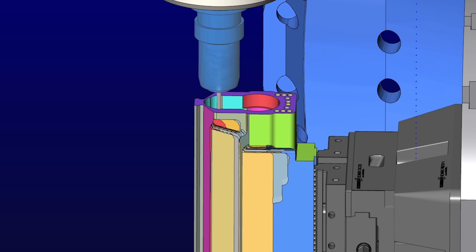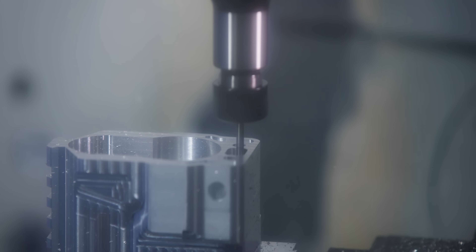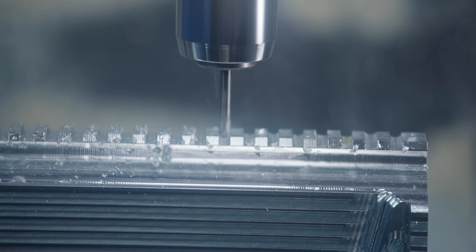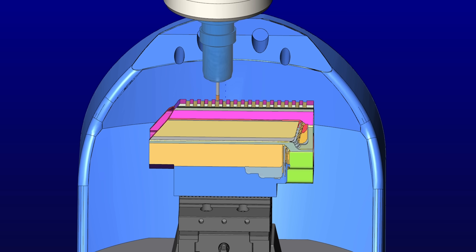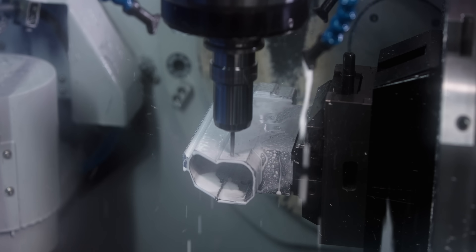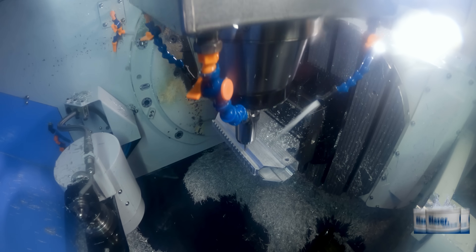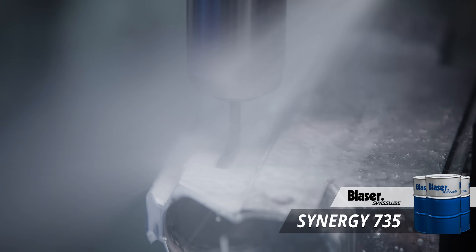Next, we're going to come in and finish our holes, rough our slots, and do the grooves that are on top of the Picatinny rail. For this, we're using a 3/16th-inch end mill that is necked back one inch. I like to use neck tools whenever I can because it makes a tool so much more rigid. We don't need that whole length of cut — we just need the reach — so in order to keep it as rigid as possible, that's where neck tools really shine.